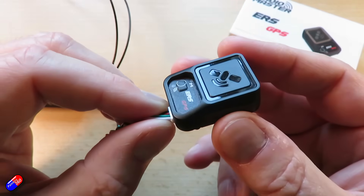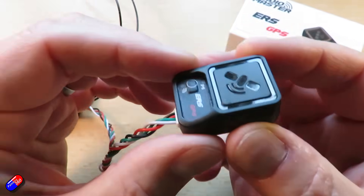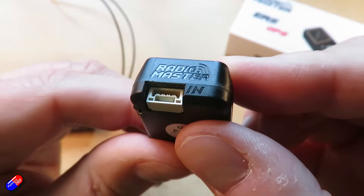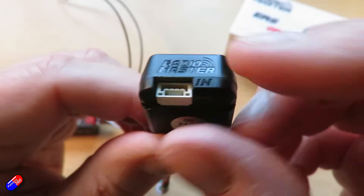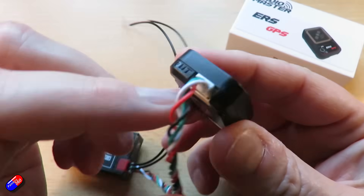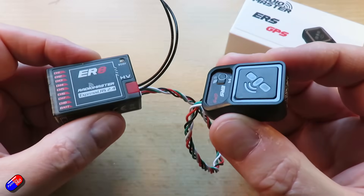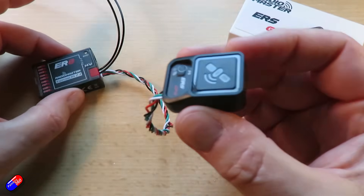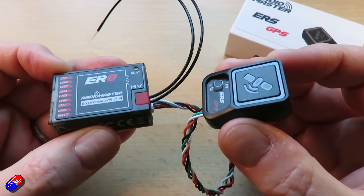You magically get GPS information through to the radio via the standard telemetry. Interestingly, if you look at it, one side is labeled 'in' which is where you connect to, but crucially on the other side there's one called 'out', so you could potentially daisy chain stuff. This is part of the power of the CRSF protocol that ExpressLRS uses — it can dynamically create hierarchical trees for multiple things connected on the same CRSF bus.